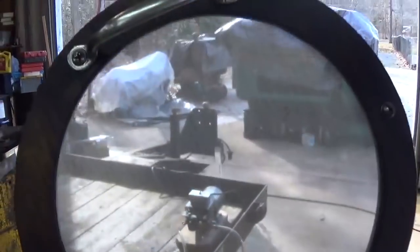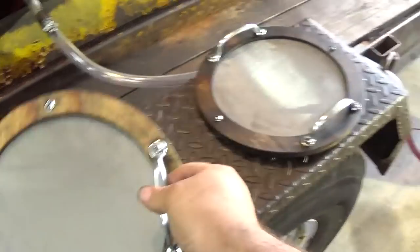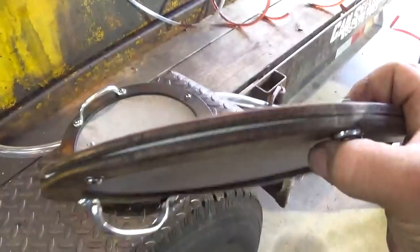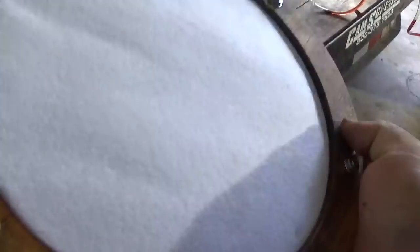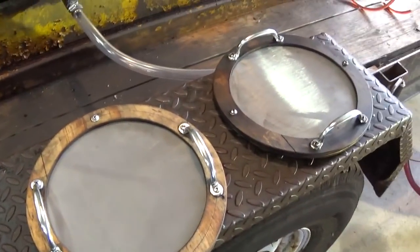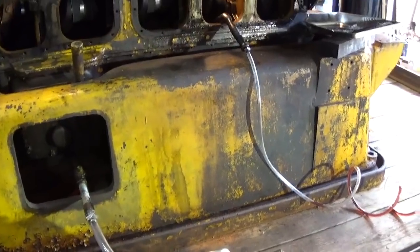These are filters I've manufactured specifically for this operation. We've got a fine stainless steel screen as the primary filter to catch all the chunks — that goes in the first bucket. The secondary filter has that same stainless steel screen, but on one side there is a layer of filter felt, which is specifically made for this application and has a 10-micron filter rating. So it'll remove a lot of the fine particulate and allow me to keep recirculating the same liquid to clean out the crankcase.